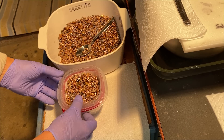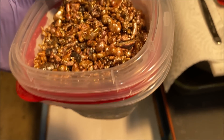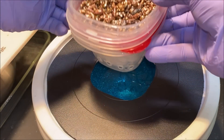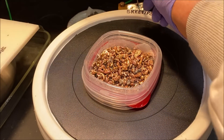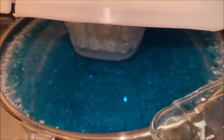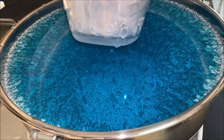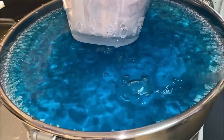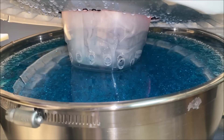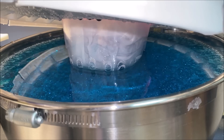Here's the newly prepared anode basket — you can see down here I've got some holes in the bottom of these cookware containers. I'm going to drop this right down in here and reinstall the anode electrode bar before we energize the power supply. Give this a little dose of electrolyte and stir it up a little bit. You can see the bottom of the anode filter basket is submerged and in contact with the electrolyte to complete the electrical circuit through the silver cell.